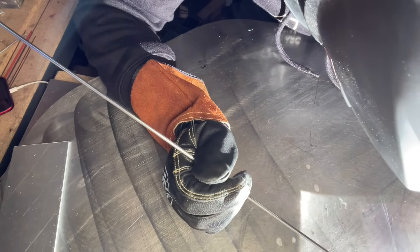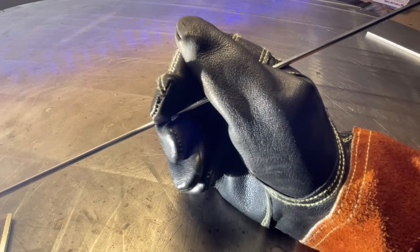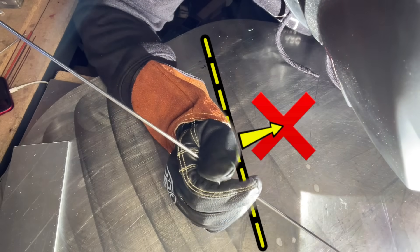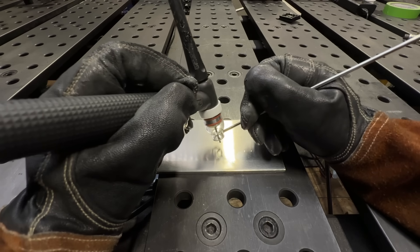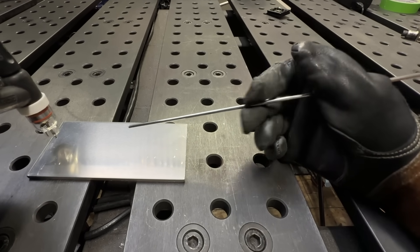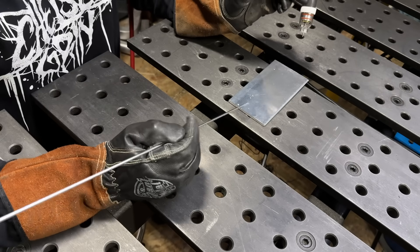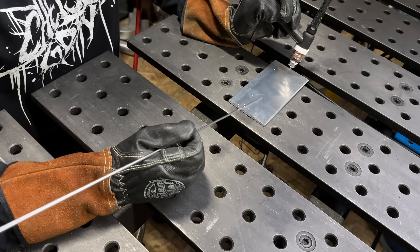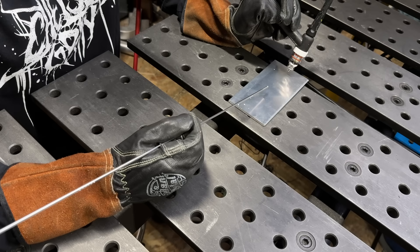There are a few different ways to hold your filler material grip, but whatever grip you choose, follow these tips. Make sure your filler hand is stationary — as you are feeding, your hand should not move at all towards the welding area. A common problem is people hold the filler material in one static spot and as they weld, the feeding hand gets closer and closer to the welding area. Don't do this. Learn to remain stationary with your feeding hand, feed the filler material all the way out, and remain comfortable. Practice in position: get set up as if you're actually welding, with hands stationary, and learn to feed the filler material all the way out and then all the way back in.